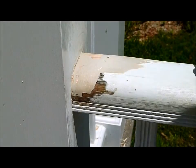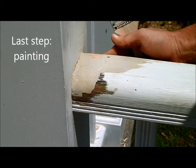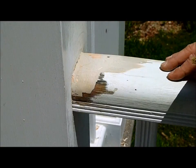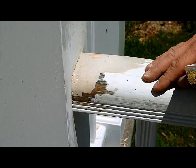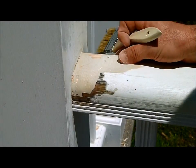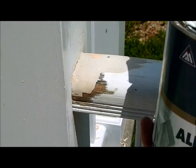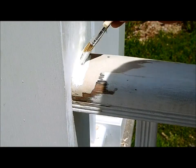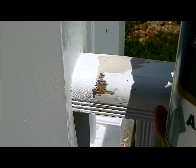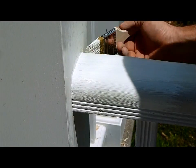I've sanded this all down — you can see the old existing wood here, and a little bit of that new wood I stuck in on the curve, all sanded down. For an exterior application this is fine. It's not totally set up yet but I'm pushing the envelope because weather is coming in. I want to get some paint on quickly. I'm using a high-quality primer — never skimp on the primer — making sure all the crevices are nicely filled. As soon as this dries I want at least one finish coat on.